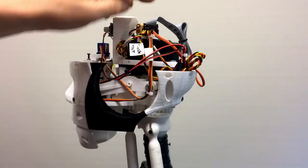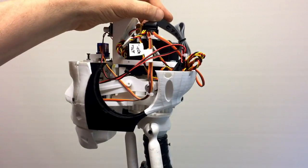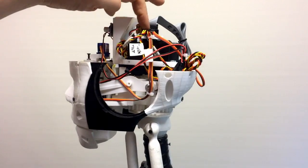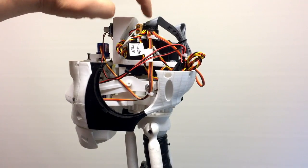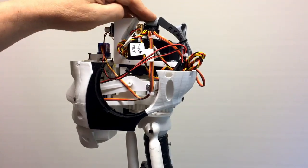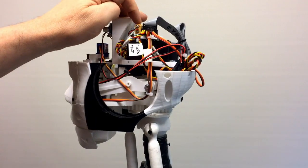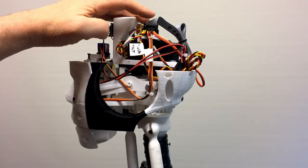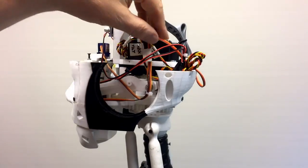That's the other side of it. That's one of Gael's boards, which is modified, and it's just bringing in signals. I've split the power rail off to one of these XT60 connectors, so that's coming off a buck in the power supply. That's running at 5 volts, 5.5 volts I think I'm running it at. That signal is coming in to the various breakouts.